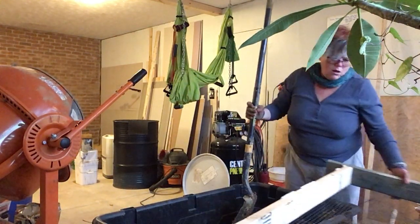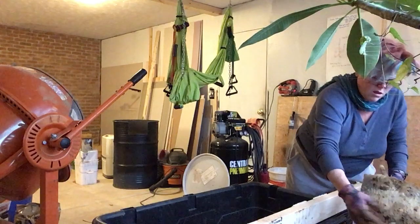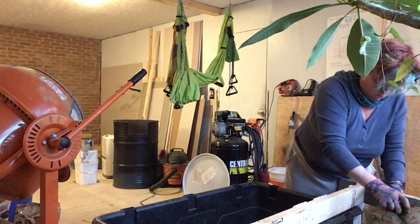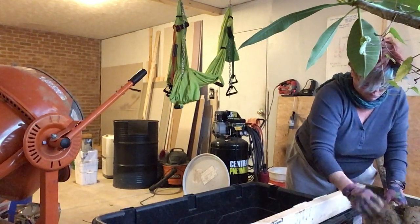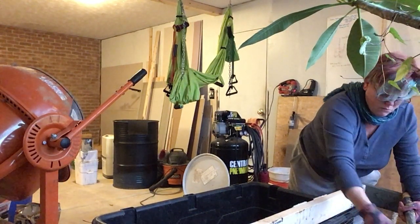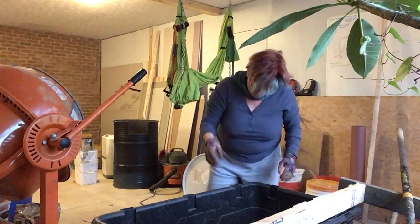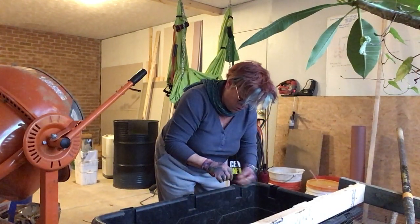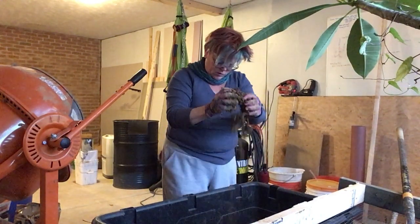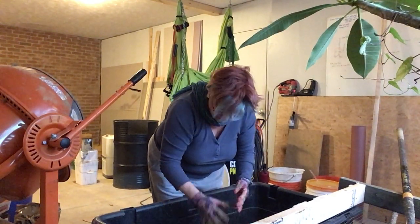Now, that's just one way of doing that. Now, in my ideal world, that coil is always going to be in a downdraft section of the stove, okay? Because anytime the gases in the stove come in contact with that coil, they're going to cool. And as soon as they cool, they're going to contract and become more dense than the gases around them, which are hot, and so they will start to sink. So if you put the coil in a downdraft section, you'll be working with the natural physics of the stove. The gases will want to flow down naturally through that coil as they are cooling, and so the stove will flow with less resistance and transfer into that water.